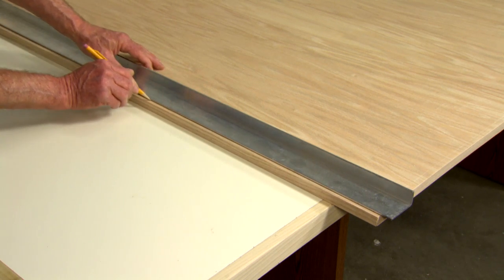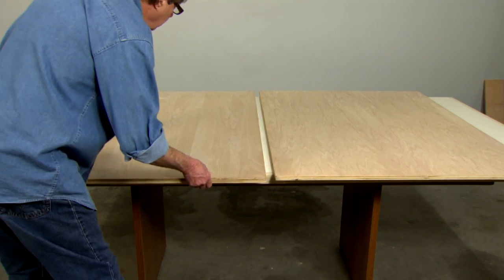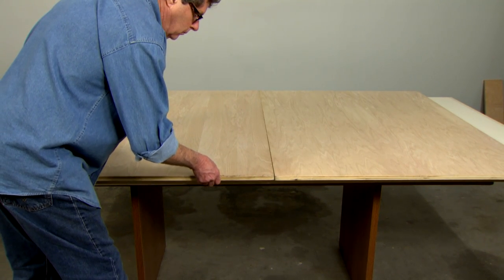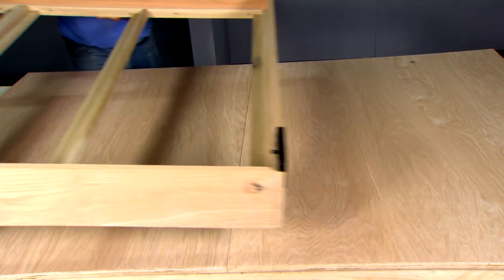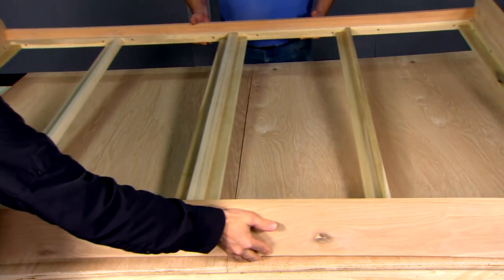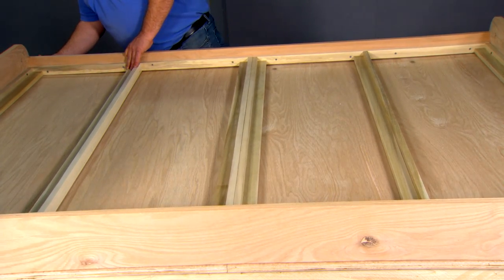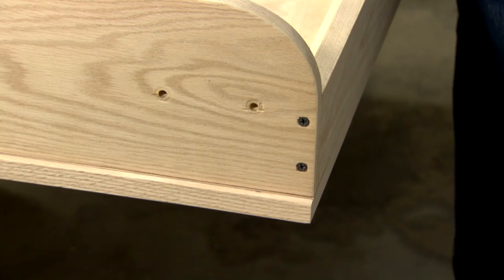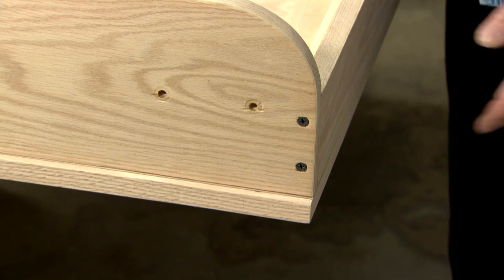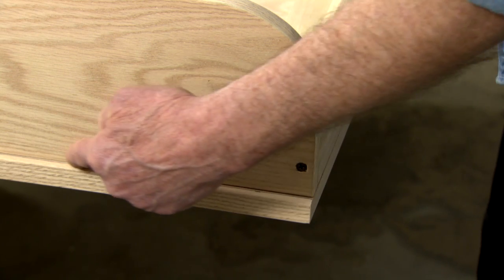With the bed face panel still lying face down, butt the two unfinished inside edges together. Make sure the quarter-inch pencil marks are visible on the outer finished edges. With a helper, align the sides of the bed frame with the quarter-inch pencil marks and lay the assembled bed frame on top of the face panel pieces, making sure the foot rail, part C, of the assembled bed frame is flush with the finished edge-banded edges of the bed face panels.